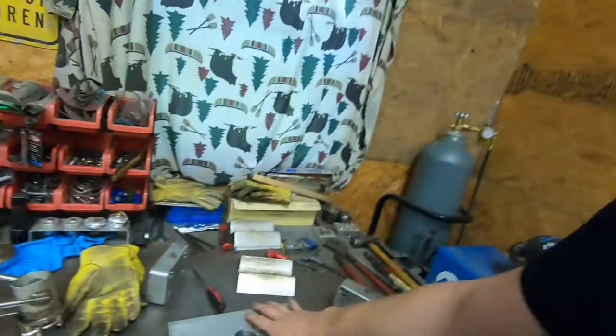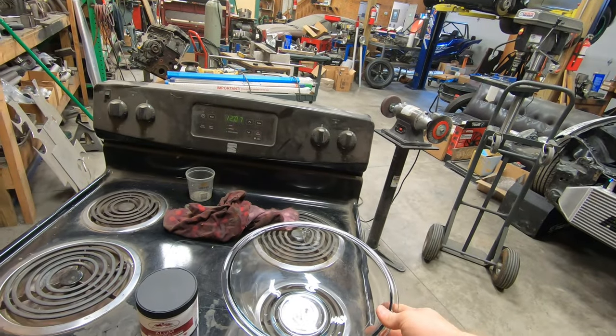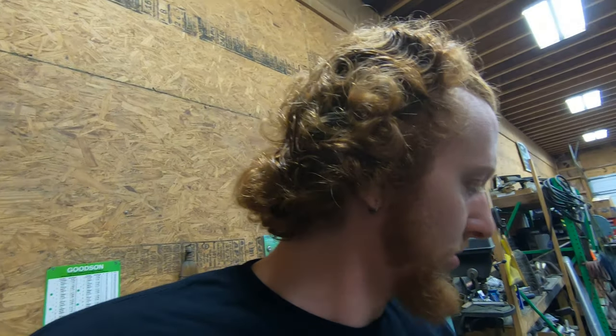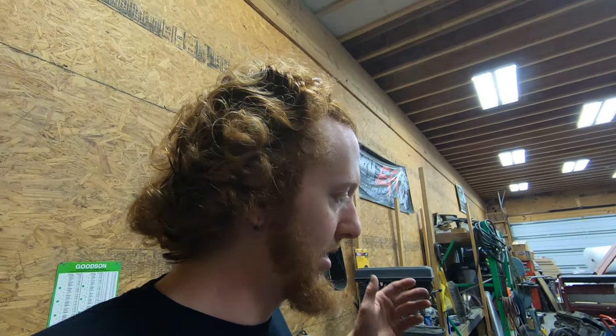What we're going to do is take both the block and this Pyrex bowl that I bought over to the restroom, fill the bowl up with water until it submerges the hole where the tap is broken off. Then we can pour this 1 pound of alum powder into it, get it to boil, drop this aluminum block into it, and hopefully chemistry does its thing and dissolves the steel tap out of the block of aluminum.